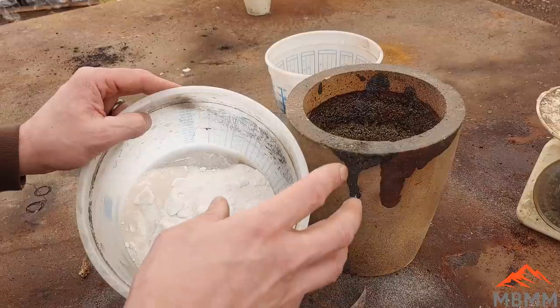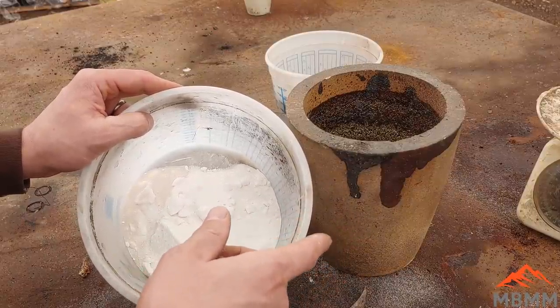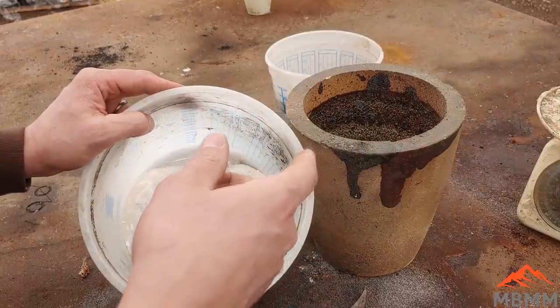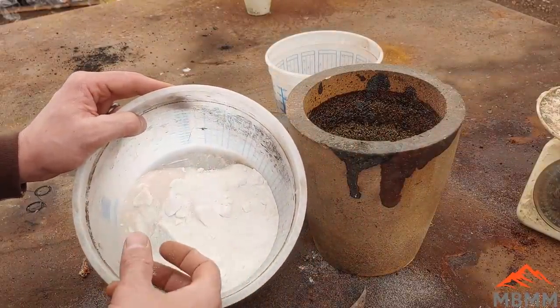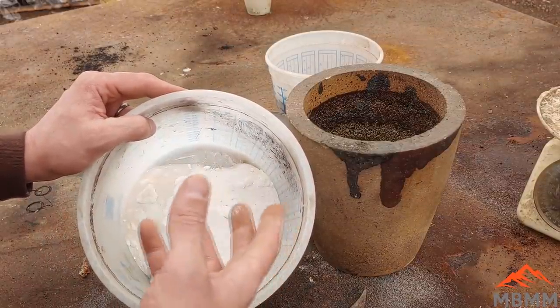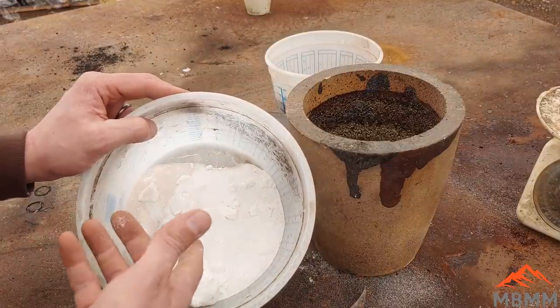And then my plan is, when I pour, I'll get the lead button in the bottom of the cone mold, and I'll remix and pour another charge in the same crucible, and I'll just put the lead back in, and the lead can collect over and over and over again, enriching that collector metal. So at the end, after our 2, 3, 4 smelts, we'll have all the gold in 100 grams of lead, rather than using 100 grams of lead each time, and then you got 400 or 500 grams of lead you got to deal with.